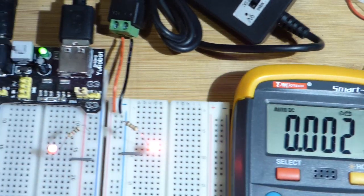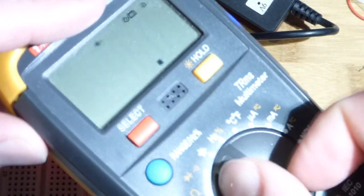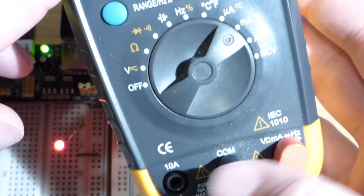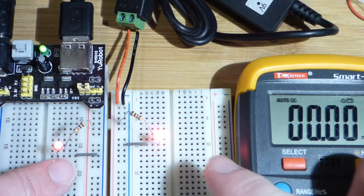These are the first measurements I've taken of it — so far, so good. This is an auto-ranging meter; that's why I grabbed it instead of my normal one. Now I'm going to flip it to measure milliamps. With my other meter I've got to move the red jumper for milliamps, but this one I don't — it makes it pretty simple. We've got to open up the circuit though.